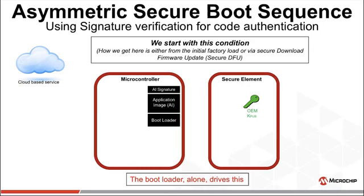There is a significant burden in code size as well as execution time for elliptic curve mathematics. Coding these crypto primitives in the bootloader could easily cause the code to outsize the bootloader, not to mention the need to secure the OEM public key. Microchip's crypto devices offer hardware acceleration for elliptic curve mathematics, with an ECDSA verify occurring in only about 50 milliseconds. Code size is also significantly reduced to a simple API call.